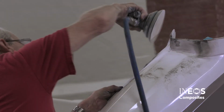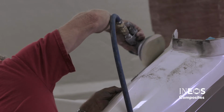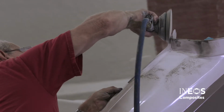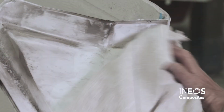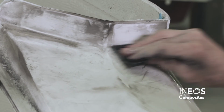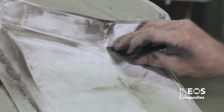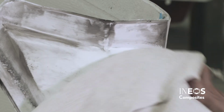The extent of sanding will vary from one gel coat to another. This is due to the difference in gel coat formulas. Some gel coats will require more time during the sanding procedures. If wet sanding procedures are used, it is very important to keep both the sanding surface and the sanding water clean. The sanding water should be changed frequently.